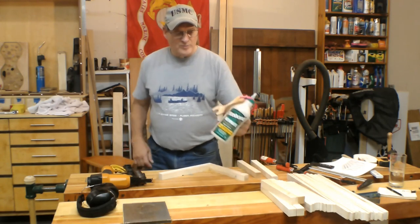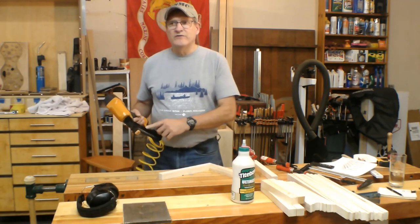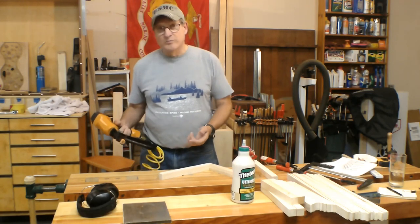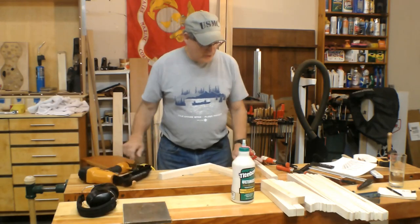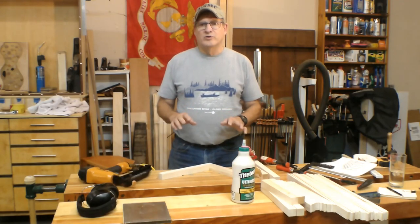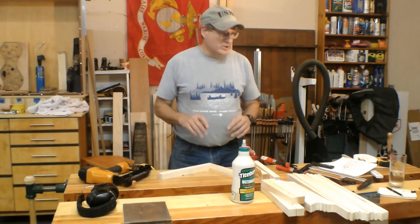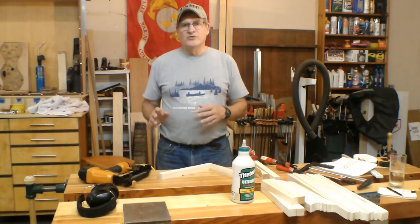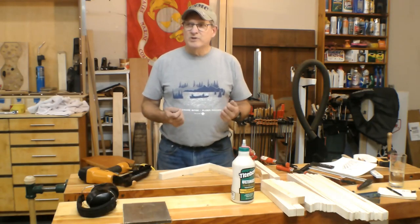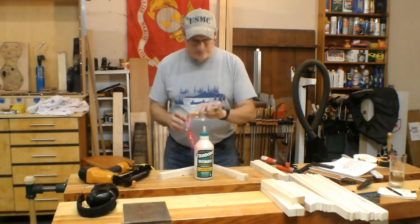Okay, I'm going to be both gluing and nailing these. I'm using a waterproof Titebond III glue and 2½ inch 16 gauge nails through a Bostitch nailer. You can find these links in the description if you're interested. I'm using the waterproof glue because it's going under my bench where I expect I'm going to be throwing wet, dirty boots. So, I want to keep it going that way. And really, the nails are a backup plan and also hold it in place so we don't have to keep it clamped the whole time. So, first thing I want to do is do a little glue down and then do some nailing.